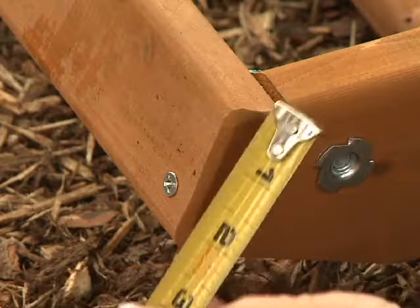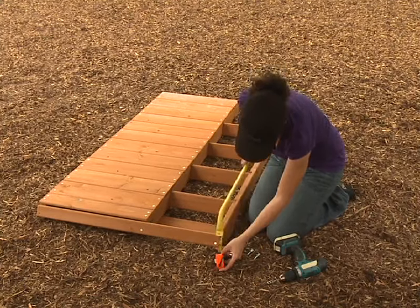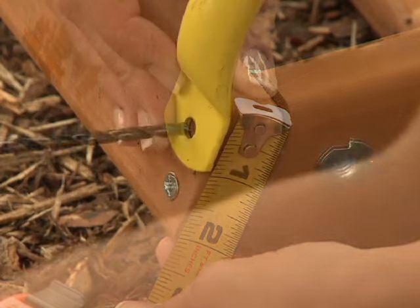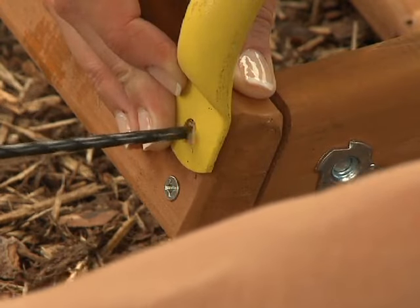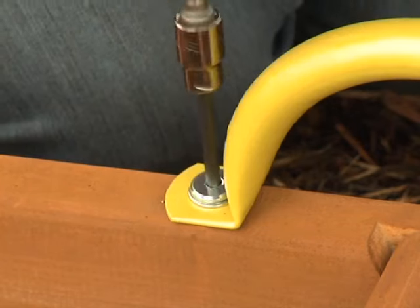Next, place the EN71 handrail 1 inch from the front edge of the top ladder on the left access rail. Pre-drill holes using a 3/16-inch drill bit, then attach the handrail using 2 WL3 wafer lags with flat washer.